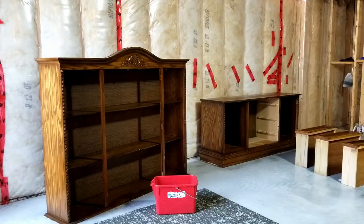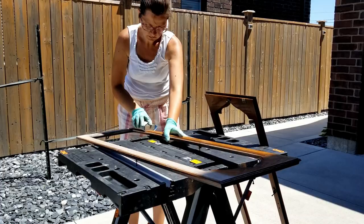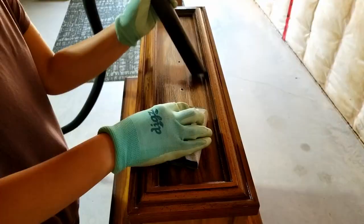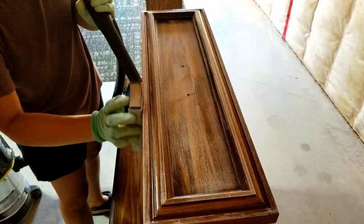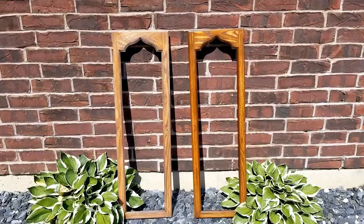Once oils and 40 years of buildup were washed off, I sanded — a lot. I don't need to get back to bare wood; not that all of this is really wood. But my goal was to remove the glossy finish. I want to paint over a dull, flat surface. Comparing these two doors, the right side is much glossier, and the left side is what I need.